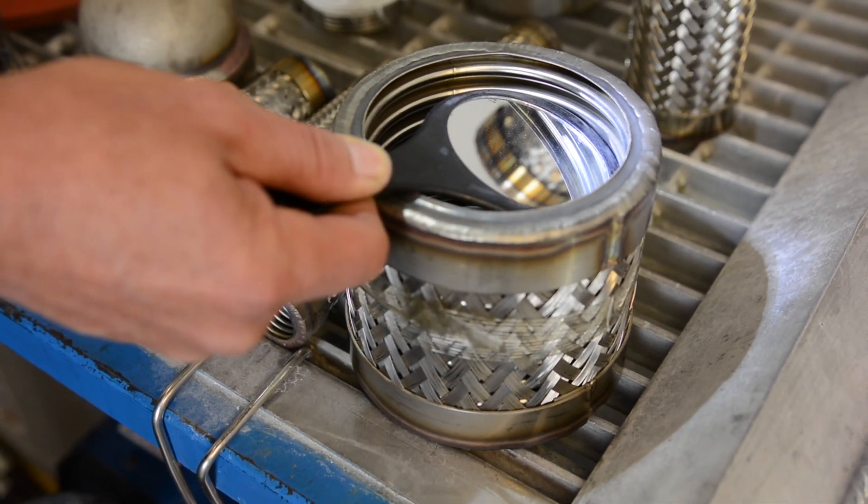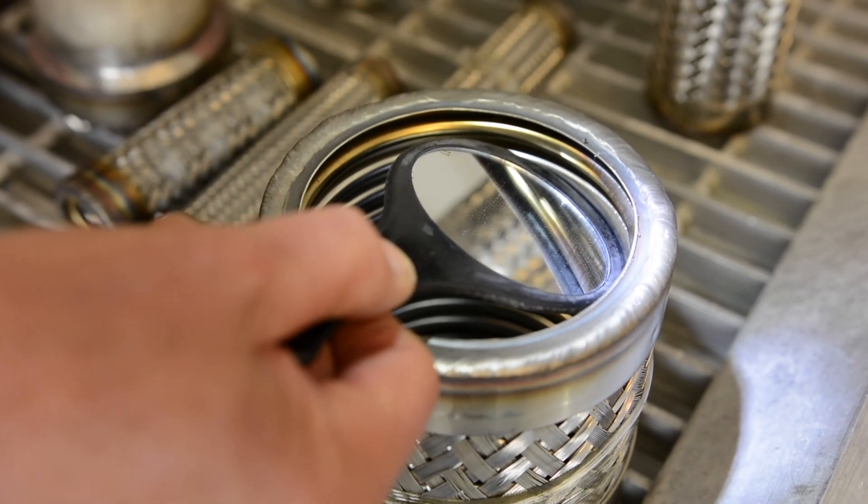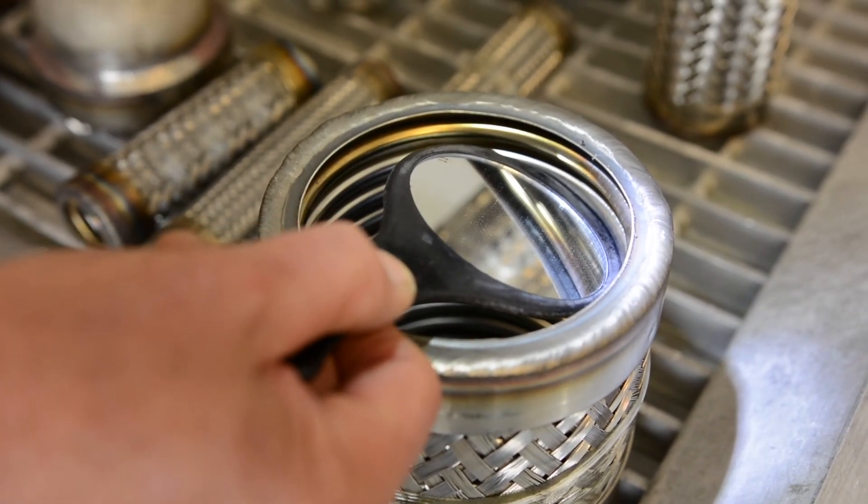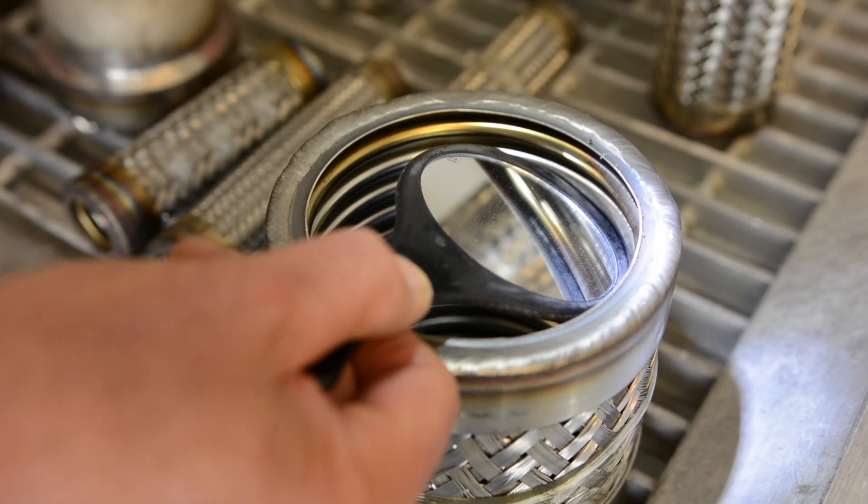As mentioned earlier, welders can better control the melt when purging, so on the assembly the silver color inside on the back side of the weld is an indication that this weld has been purged properly. Looking at the back side of the purge weld, you'll notice there is consistent silver and clean penetration. In contrast, a telltale sign of an unpurged weld is a burn through. You can see gross oxidization in the form of gray crystallization — we call that sugaring.